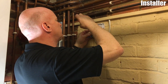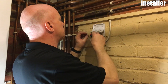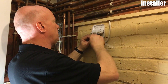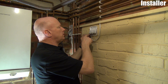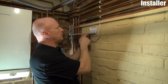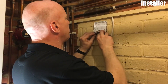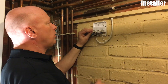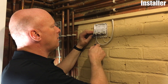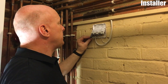It's nice having this little flip-up terminal cover because you can actually see that you're putting your cables into the clamp itself — sometimes it's not easy when it's pointing downwards and you're trying to look up. Now, because we're using 230-volt switch live, we need to make a little jumper to go across from the second live terminal across to terminal A to provide the 230-volt switching. So that's basically wired up: earth, neutral, live, jumper live across to port A for 230-volt switching, and then the switch live output. That's the relay box basically wired up.